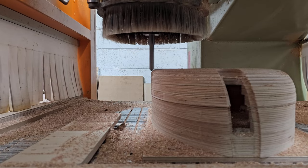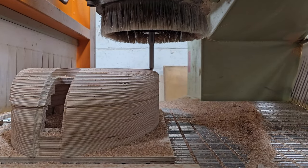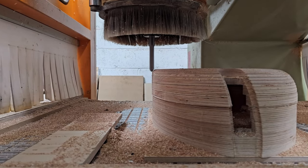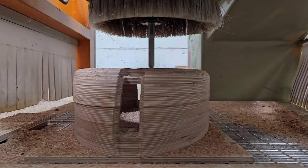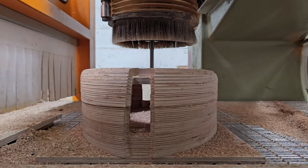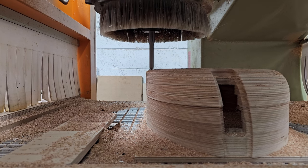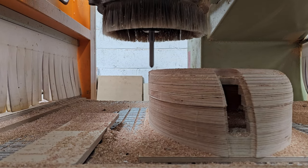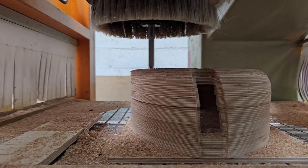Very annoying. For a program of this size and this length, so this is 27 minutes this has taken, for doing big runs of these, we're making 8 of these, it is actually worthwhile me trying to reduce the time it spends rapiding. That's why, as it's rapiding, it's only about 10mm above the work surface, to shave off some time there. Not really sure what it's doing here. There's some fine finishing stuff.